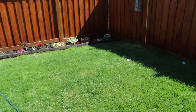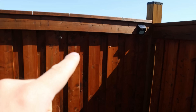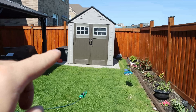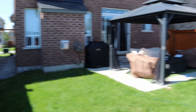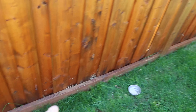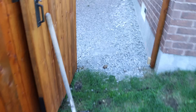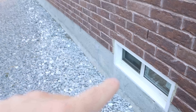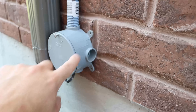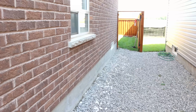Let's go check out where we're running this. Here's the backyard — I think we're gonna put the camera right in this corner. It's a little dark right now, but we'll probably mount the camera up here and the box a little lower. I was originally gonna put it on this shed that we just built, but I don't think that's a good idea. I want to capture pretty much all this area and then our back gate, which is right there. For the cable run, we're gonna be going up a line in the fence. I already made some marks where we can lay the cable somewhat underneath this piece of wood, and then we'll follow it all the way down. I made some holes in the grass line right here so we can run the cable underneath it and then go along the wall with the gravel. I've already lifted up a ton of the gravel, so we'll just lay the cable on the ground. This is our entry point — we'll make a hole in this and seal it after, and this goes pretty much to where my LAN room is.